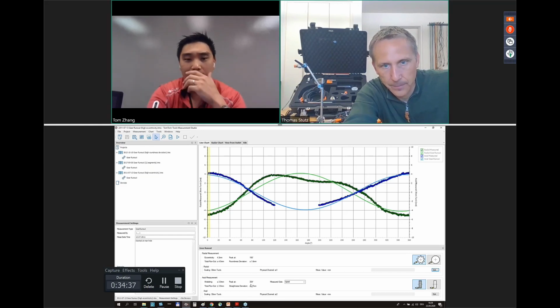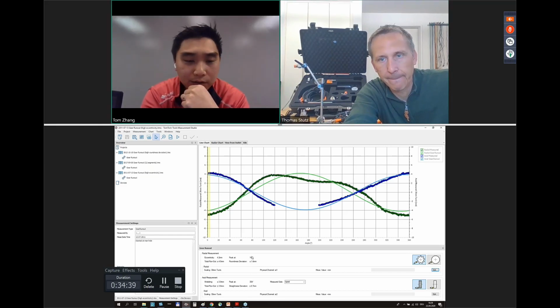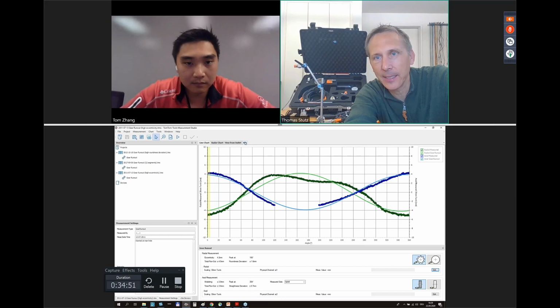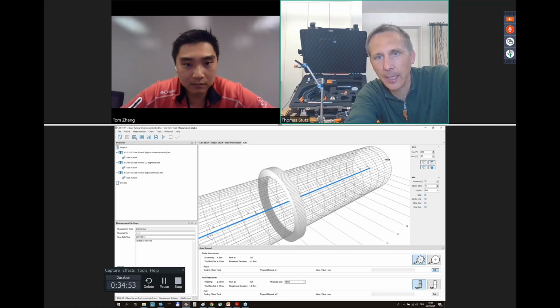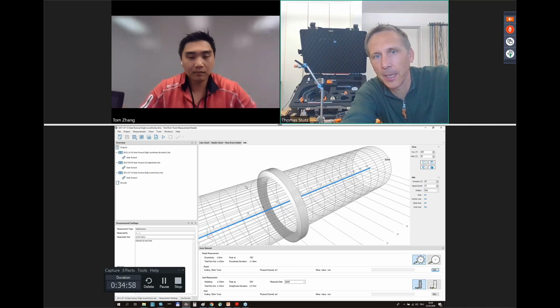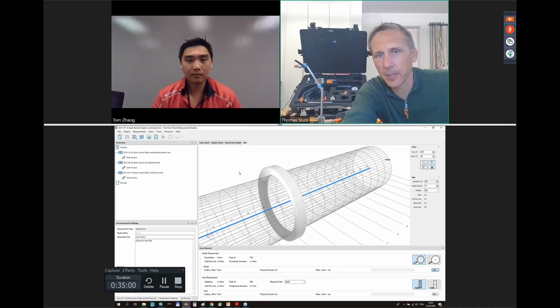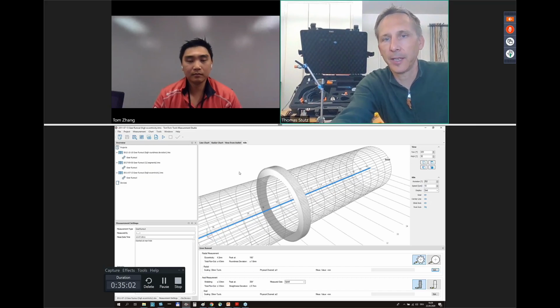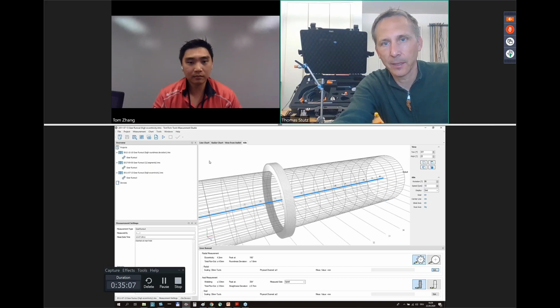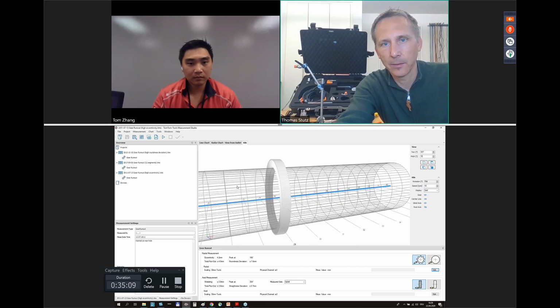Right. Hey, I think you mentioned on your new version, you can actually show the gear wobble on the kiln. Oh, yes. You can switch here to kiln. Then you get the 3D view of the kiln. On that kiln only the gear was measured. If we had shell runout or other measurements, we could include them in the same model. And here you see the gear. When I turn it, you see the gear.